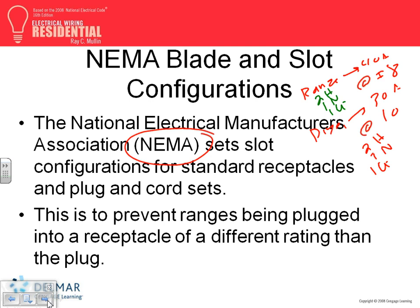Reflection, yeah. Do they make an actual range box now? Because what we used to do is say you can use a 4-square metal box and then a mud ring, and mud ring it and put it there. I was just wondering if they actually made it. I'm not aware of it, but I know exactly what you're saying.